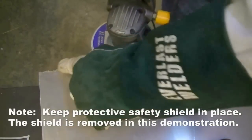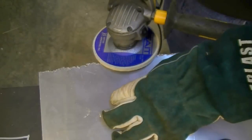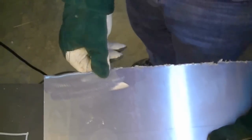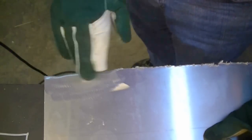We're going to take a little bit of this piece and dress it with this specialized aluminum grinding stone — just taking a little of this edge off here to demonstrate. You can see how it works: it actually takes the metal down pretty fast. It doesn't over-grind it the way a standard grinding disc with steel would, but it does take it down pretty quickly and leaves a nice finish so that you can wipe it down with acetone and weld it later.